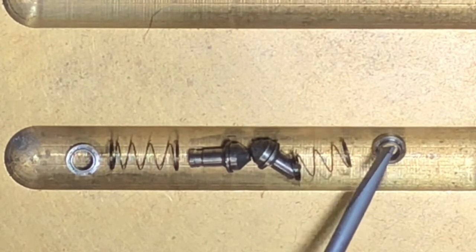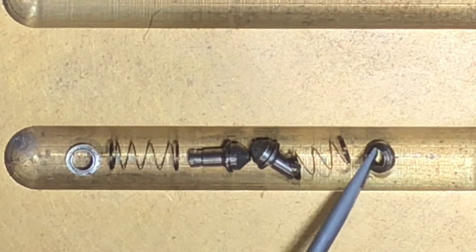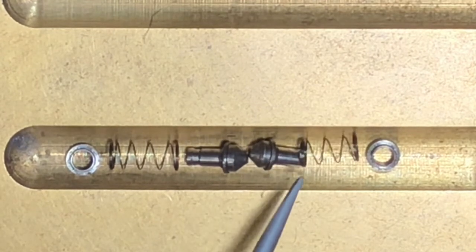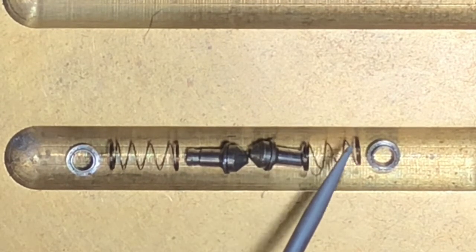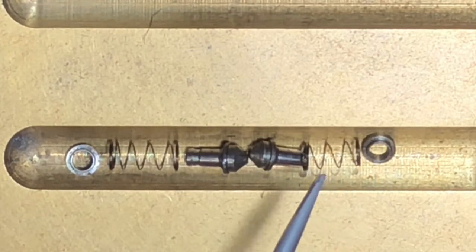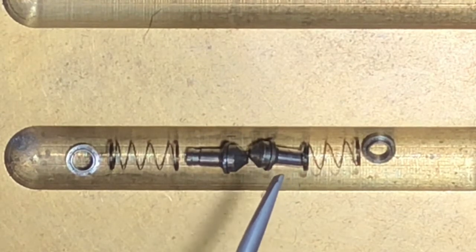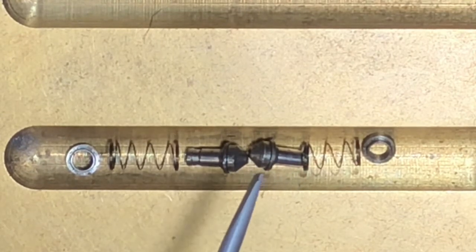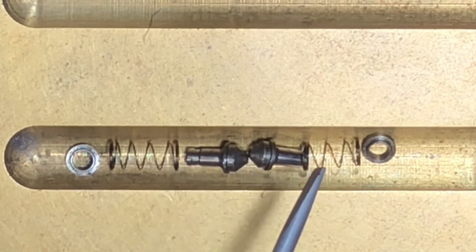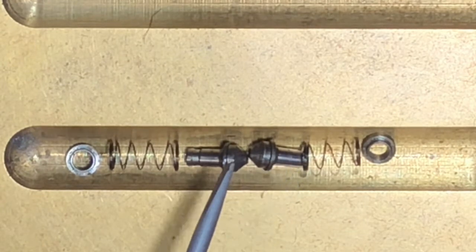Well, imagine this is flipped up like that. So that's captured. Everything's captured and it's even. So obviously you're using this to exert spring pressure in. All of these pins are trying to drive themselves in. And what that means is one of them protrudes out past the shear line and the other one either doesn't or is right at the shear line.